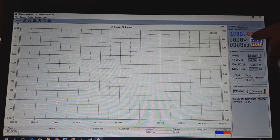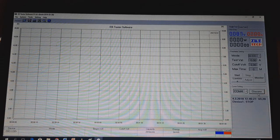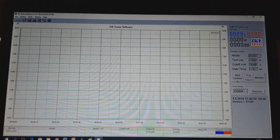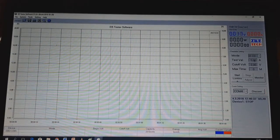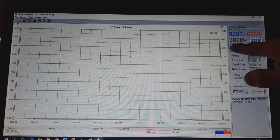This is the amperage — with this amperage setting, the program and electronic load will discharge your battery. To set the discharge current, you set the test value here. I have a power bank with high capacity so I can set it to 1 amp. If you test smaller batteries or smaller super caps, the maximum discharge current should be 100 or 200 milliamps, because discharging at 1 amp would make the test time really short.